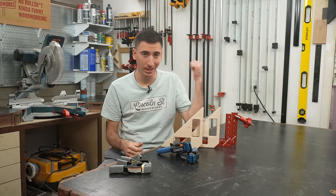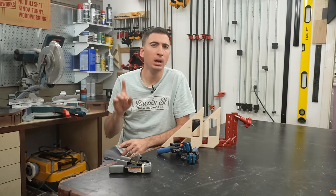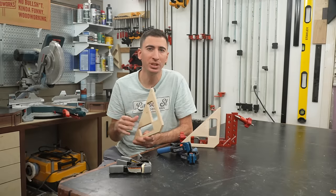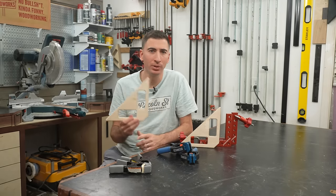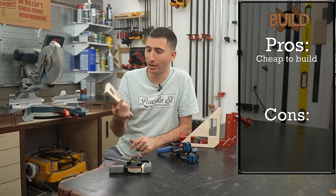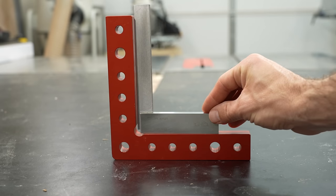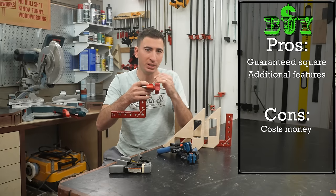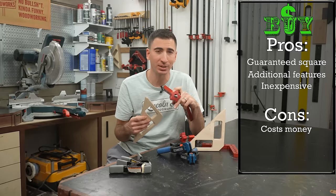The toll roads of woodworking are clamps — there's no way around them and at some point you need to pay up. Pipe clamps and F-style or trigger clamps are basically mandatory. Let's do a rapid fire of two specialty clamps. First up: 90-degree corner clamps — their function is in the name. They're used to keep parts held together at a perfect 90 degrees while assembling builds. You can build them out of plywood, but the only thing that matters is they're actually dead-on 90 degrees or you defeat the whole purpose. Purchasing comes with peace of mind, and cheaper sets can be had for less than $50. Buy.